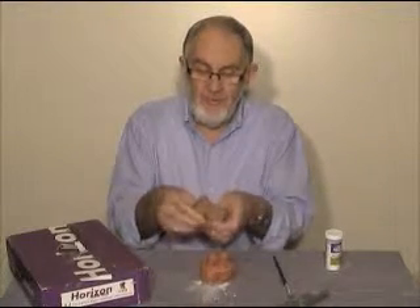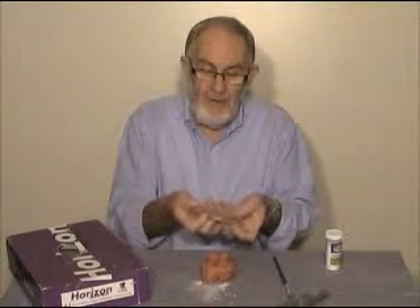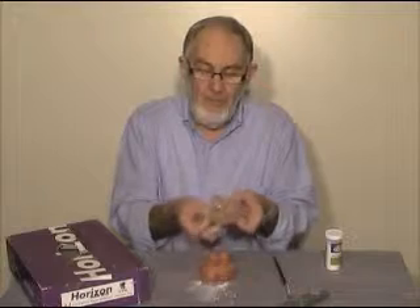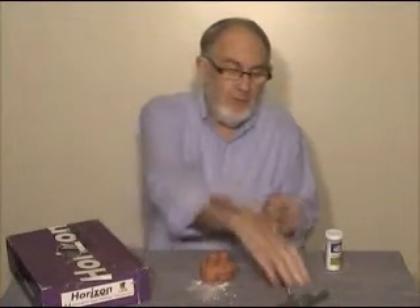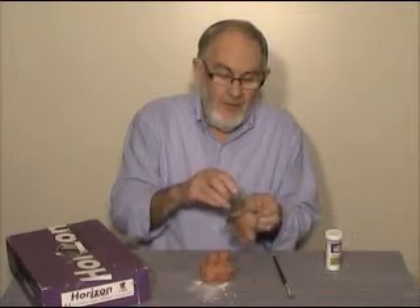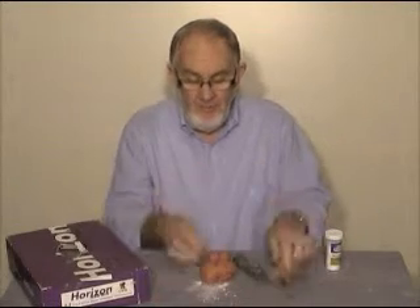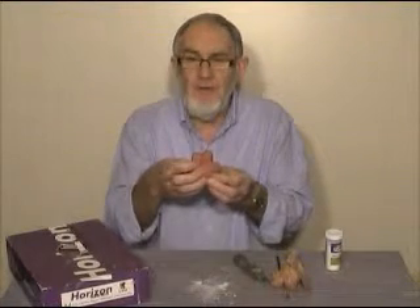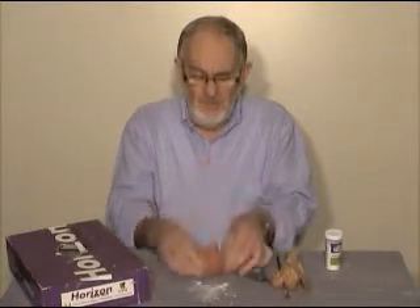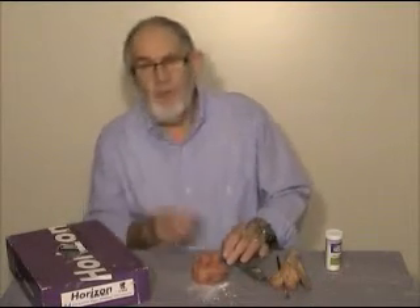So before I cast it, what I did was just place a little cut in here, so that when it came time to pull it out, the latex that was joining together underneath their chins I just cut with the Stanley knife through there. And that enabled me to peel the mold off, and yet it's still formed with this shape underneath their chins. There we have it — ready for coating, which will be the next video. Thank you.